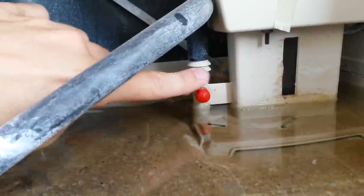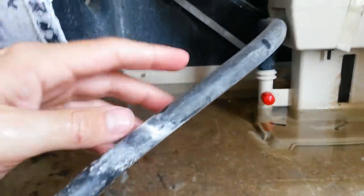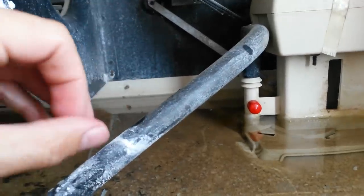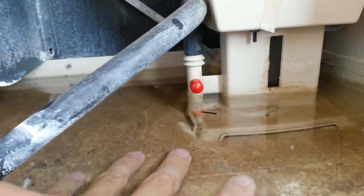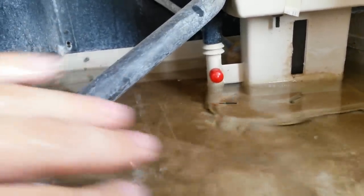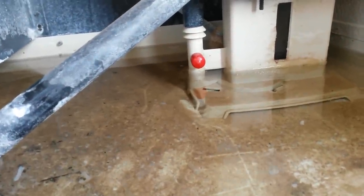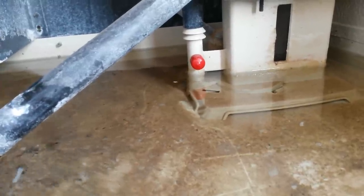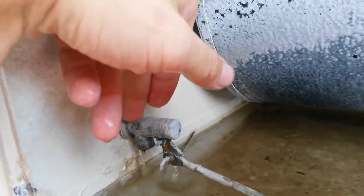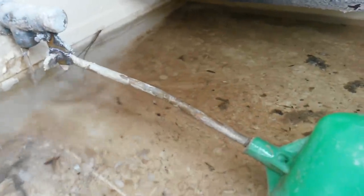There's quite a bit of water that comes out of there, but it is an effective solution. There are also pellets you can get — they almost look like big chunks of clear rock salt. They go in a little mesh bag that sits down in the water, and that kind of helps to take the solids out of suspension. I have tried it before but didn't notice a dramatic improvement, so I haven't really used that. You can also get canisters that go in-line with your water supply before you hit the shutoff valve, but I haven't noticed them to be especially helpful either.